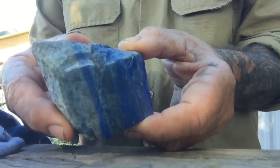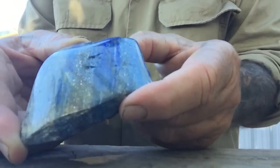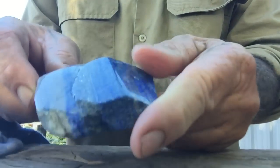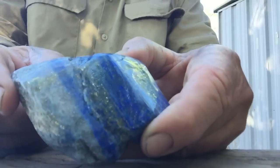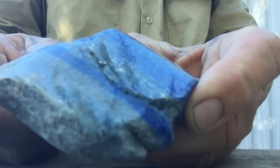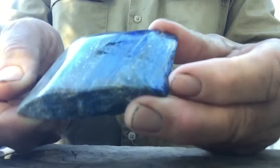Now, if you don't have a lot of gear and you just want to start with the items I've showed you, this is enough. It's almost a mirror finish. But I do take it a step further. I put it onto a buff wheel, a metal cutting buff called a stitch sisal buff. They're pretty cheap to buy in the hardware shops.